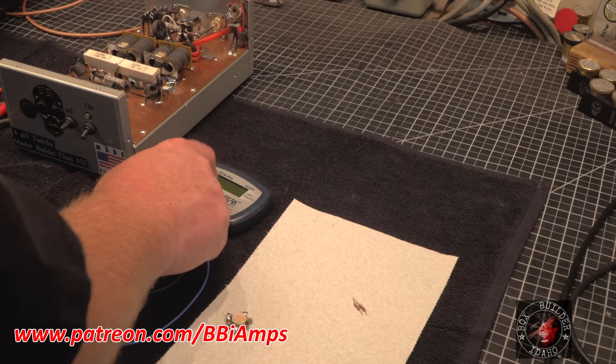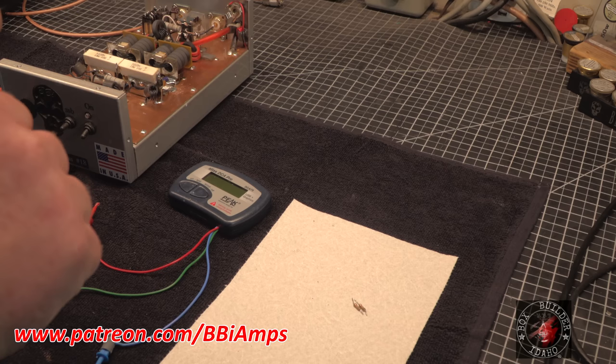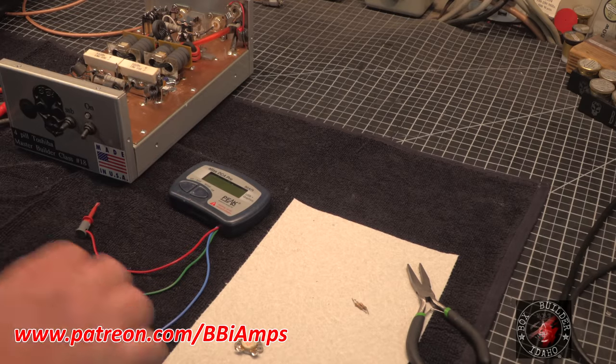It never ends. This little device, it's pretty interesting. The critical hate chasers on Facebook, the self-appointed know-it-alls, like to point out that this thing doesn't give you a very accurate gain number because the voltage in its battery is so low. And I'm like, okay. I'm at the point now where I want to do a little test video, because I have a feeling this has an internal rectifier circuit and it kicks the voltage up to whatever the component needs. I only say that because when you put the device on a curve trace, it definitely kicks the voltage up closer to 12. So just because the battery's at one voltage doesn't necessarily mean that's what the component puts out.